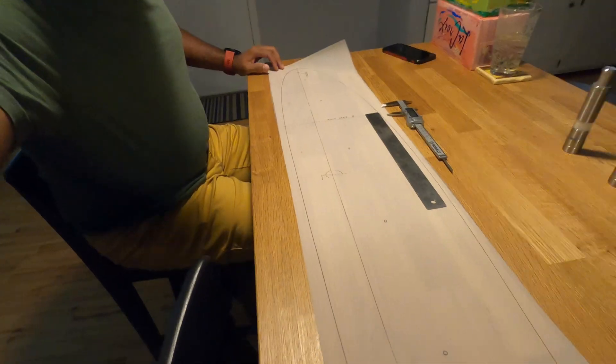Since the last video I ordered cap strips for the wing spars. While we're waiting for those to show up, I'm going to mock up where the skin gets riveted to the ribs. I'm going to use the full profile of the wing and mark those up every inch and a half according to the plans. Enjoy the time-lapse.